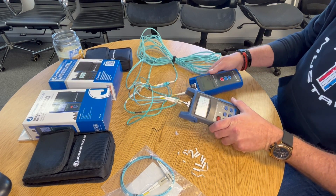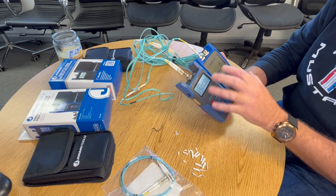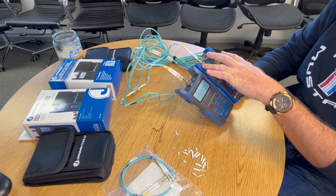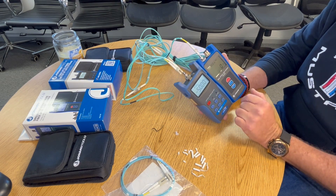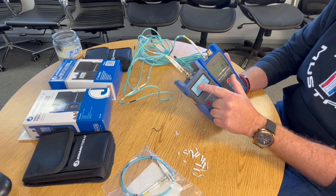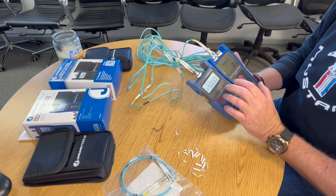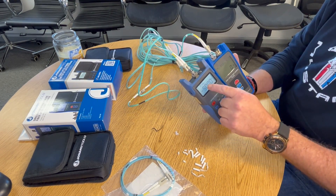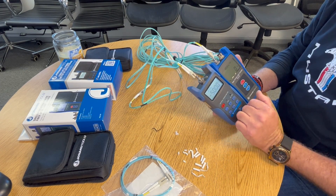Before you work with these, whether it's MDF, IDF, or vice versa — main point to secondary point, wherever you're running the fiber — you have the LCs in there. Before you test, you're going to make sure your wavelength is correct. Multi-mode, single mode — you can Google all the specifics. On this unit, you want to pick a wavelength for multi-mode or single mode, whatever the case may be.